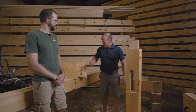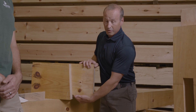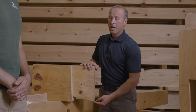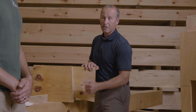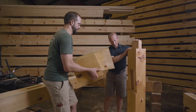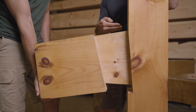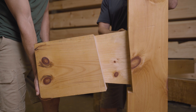So the floor of the mortise slants from 111 and a half inches down to 110, a total difference of an inch and a half. The reason we do that is to lock the beam onto the post. The bottom of the tenon going into the post is also cut on a slant — a one and a half inch taper — and you can see the one inch taper on the side of the beam. When we put it together, the beam enters the post at 121 and a half inches and as it slides in it lowers an inch and a half, so the top surface of the beam ends up at 120 inches.